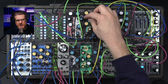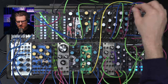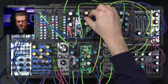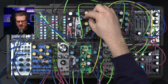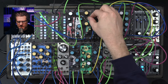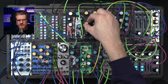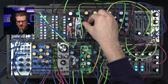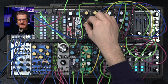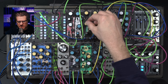And then we have density in a switch. If you want something a little smaller. There's the density. It does sound a lot fuller with that on, but sometimes you just want a little blip, so you get that too. Then you have a high pass filter. This high pass filter is a little bit resonant, but the resonance is static. It's not adjustable. We just sort of set it where we thought it sounded nice and stuck a resistor there.